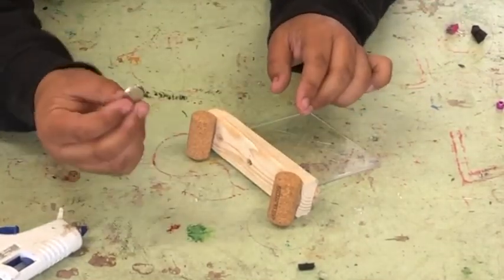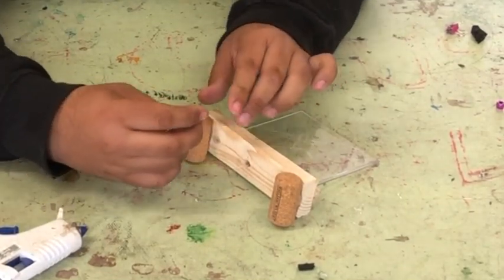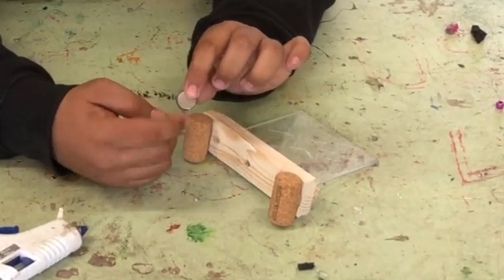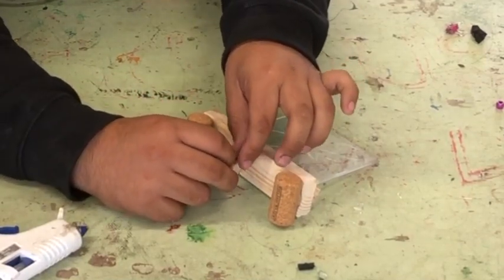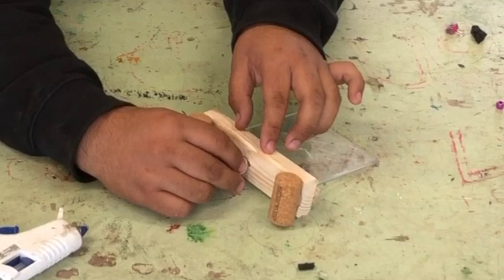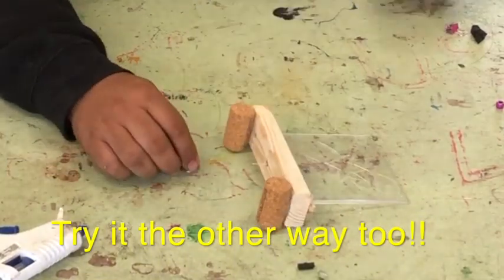So you could even take your battery right now. There's 2 legs on each of your LEDs. The longer one is gonna go on our positive side, on our plus side. On the battery, you could see one side with a little plus sign on it, and the other side is our minus, or our ground, or our negative. And that's where the short leg is gonna go. So I'm gonna line up my positive with the positive and squeeze it together to see if the light turns on. The light's turning on, so that's working.